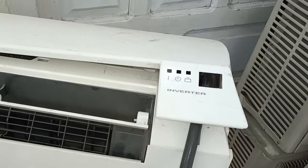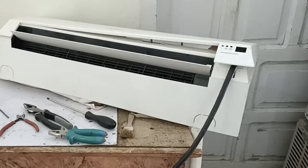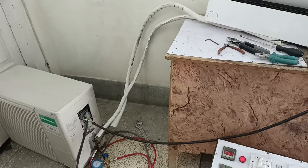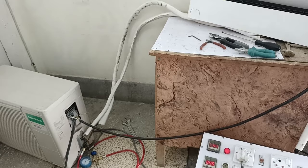The indoor blower motor is working. The green light on the display, which is the operation light of the air conditioner, is working. The customer didn't notice the blinking of the air conditioner and sent the complete unit to me, but the unit is showing some other problem here. This air conditioner works for 15 minutes, then stops for 1-2 minutes, and then starts again, but stops after 15 minutes again. It is now the fifth time that the air conditioner has started and stopped.